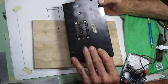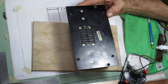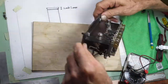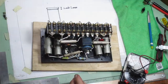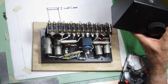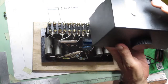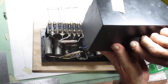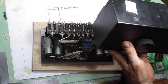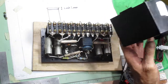The last important thing: you really want to protect this plug because it's no longer manufactured and is not replaceable. When you remove this module, it has studs to protect it when you set it down. You should lock the tube board that this tilts down on completely solid. When you remove this, support it and carefully unscrew this — the screw will actually push it off that plug. Be very careful and aware of that plug; it would be a disaster to wreck it.